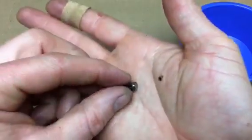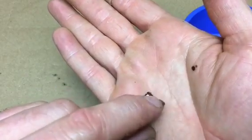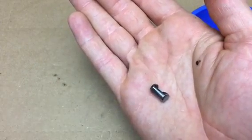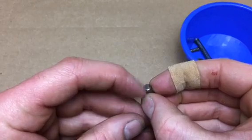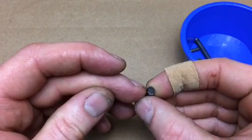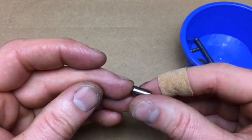Okay, so I am going to polish the firing pin block as well. You'll notice the outside surfaces here that rub along the interior of that hole are polished smooth as glass, and the head of it right here that the sear actually maneuvers up and down as the gun cycles is likewise smooth as glass. I want those, again, wet chrome. Ultra shiny. These will come rough and black and gritty, and I want that gone.